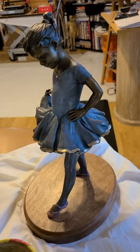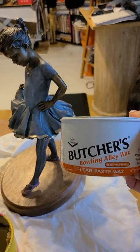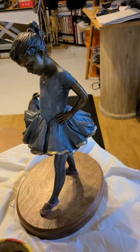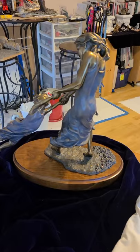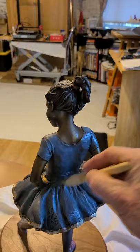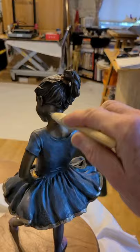You might find other types of wax too. I've tried a few of these — bowling alley wax and also Minwax — just because they tended to be easier to find at hardware stores, but I did not like the effect of those. Also, just from trying to have consistency with what I know the foundry has already put on my sculptures, I want to use the same thing. That way there's less variation and less of a chance of either the wax not staying on as long as I want or ending up changing the coloring.